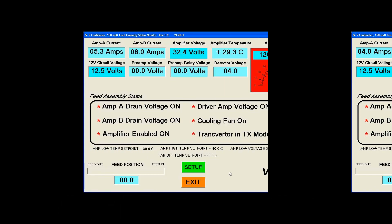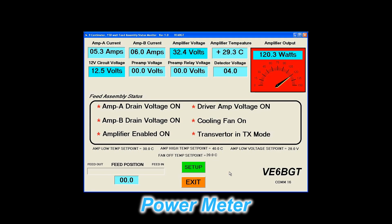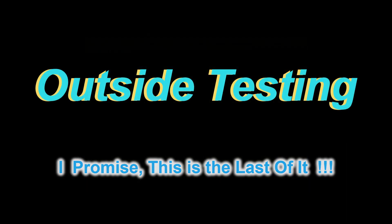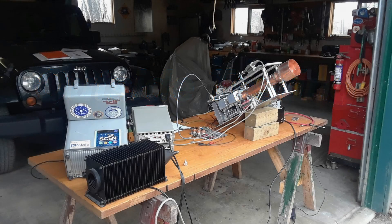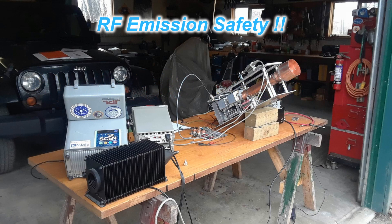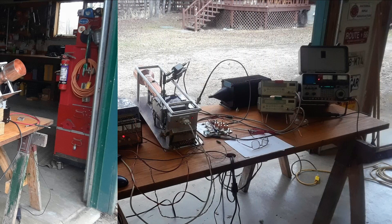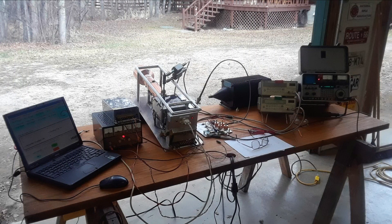It's a never-ending development because I keep coming up with new ideas. So this is where I drag it all outside, hook it to the actual feed waveguide horn and spray some RF out — I wouldn't dare do this inside the house. It's essentially the same setup as on the bench — still using the IFR and the transverter for the 3.4 GHz drive source — and I have a small laptop running the diagnostic screen.